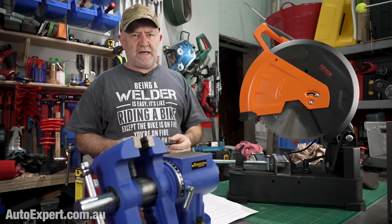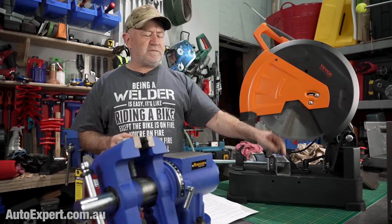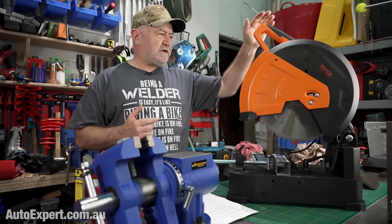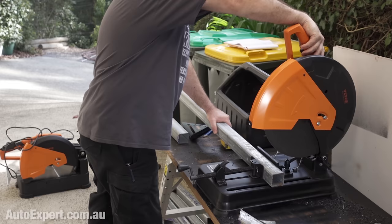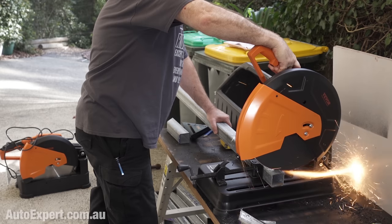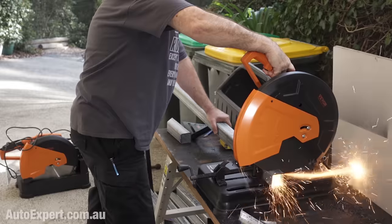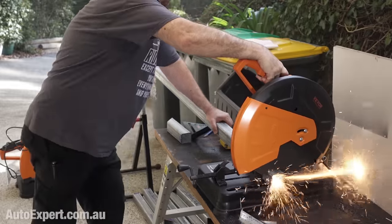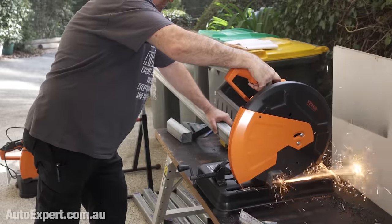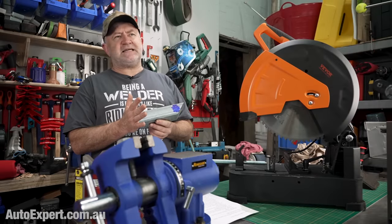The angle grinder is a very dangerous tool in the wrong hands, and the thing it's worst at is large scale cutting. The equivalent abrasive chop saw — which I've also got from Vivo — is slightly less than $200. I did a test: the same 90 degree cut that took 8 seconds on the tungsten carbide saw took 35 seconds on the abrasive saw — roughly four times longer. And with a whole lot more fuss, because there's a lot of red hot sparks, an inherent fire danger — quite significant here in Australia — and it just takes longer, it's noisier, and more dangerous.